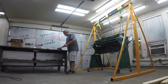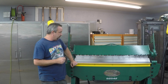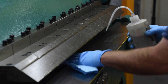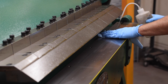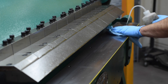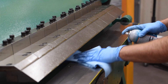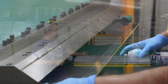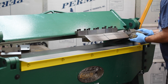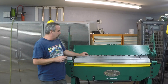It's mostly assembled — there are just a few things you need to do. The first thing is it comes packed in cosmoline, this waxy sticky stuff that looks kind of like oil but isn't, and it's not meant to be on there long-term. So you need to use some solvent to get it wiped down and cleaned off, then oil it down with a good penetrant or lubricant for protection. You also want to take all of the fingers off, turn those upside down, disassemble them, get those cleaned as well, and then put it all back together.